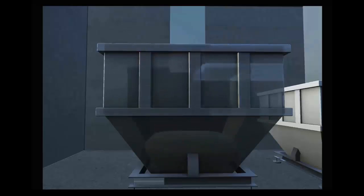Major and minor batching scales weigh ingredients from overhead bulk bins. In an automated feed mill, the first step is to add or draw ingredients to the major scale. Ingredients can be added with either screw conveyors or air gates.